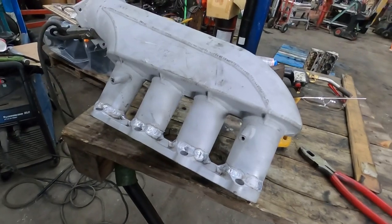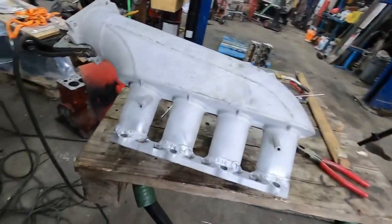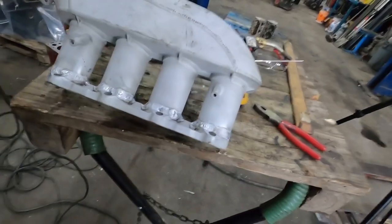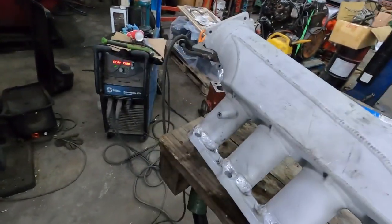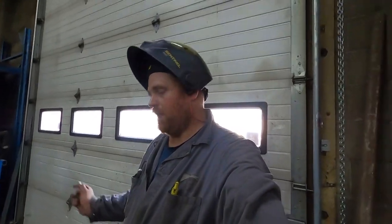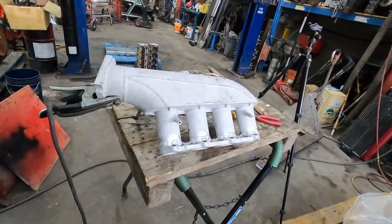What I really need to do is set up a good welding table again - I haven't had one in a couple years since we moved the shop around. It's not the prettiest but the material is still dirty, and that's just how it is with used aluminum, especially on intake manifolds, oil pans, and tranny pans. Unless you cook the oil out of it, a lot of times it's really hard to get a good weld. Today was just not my day for welding. Anyways, we got it all welded together - like, subscribe, hit me in the comments and catch us on the next one.